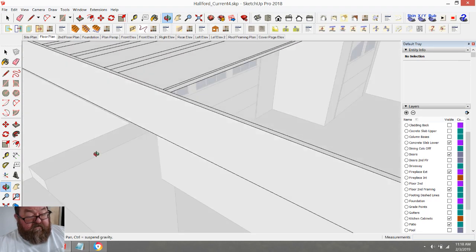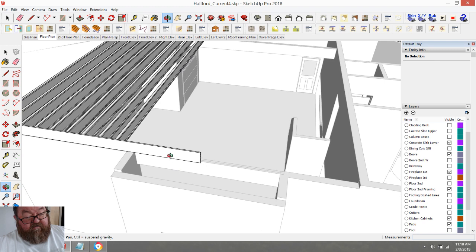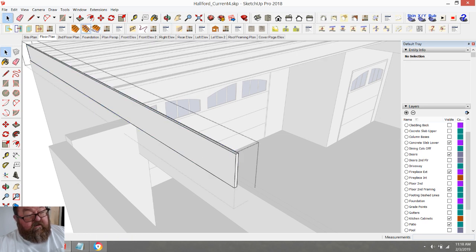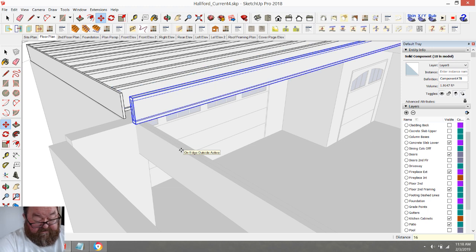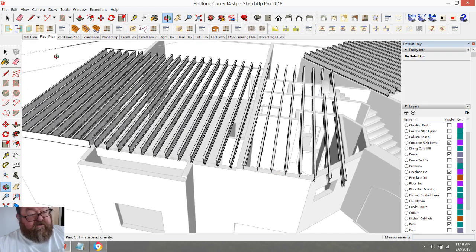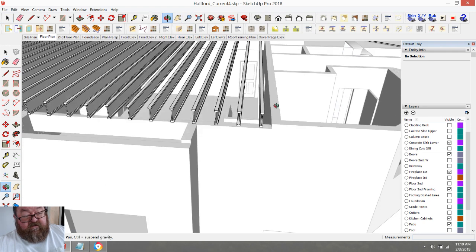So now I'm going to pull this. Let's see. Do I have bearing there? Yeah. For now, I was just trying to demonstrate how to figure this. I'm going to go ahead and copy more joists over and then delete the ones I don't need. But for now, I'm going to take this back to there and then come a 1/2 inch this way. For now, I'm going to go 16, and I'm just going to times 20, and I'll just delete the ones I don't need. I don't need a bunch of them, because right here it's going to start a different system.